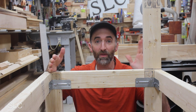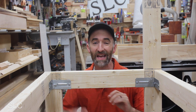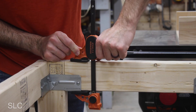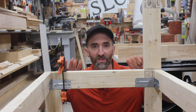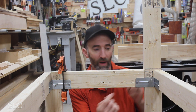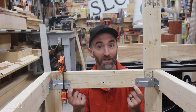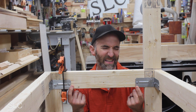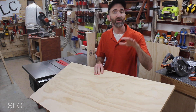I finally got all the wood that goes from front to back connected. One thing I discovered: when installing these pieces, always use a clamp to squeeze the top of the wood and the bottom of the metal together so it holds everything nice and tight. Otherwise you'll easily get gaps, and when you put the screws in — as I experienced by accident — you'll get so many things out of alignment.